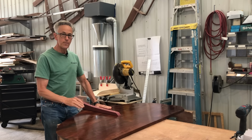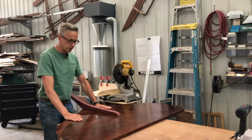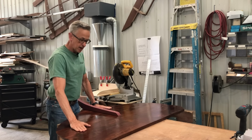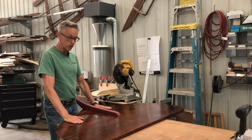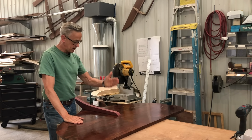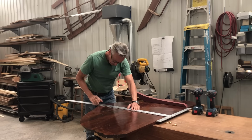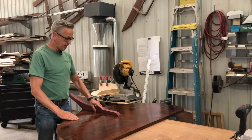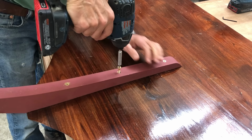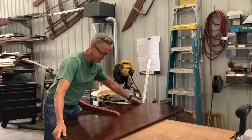Before we can put the Ribbands on, we need to prepare the transom to be placed on the jig. So the first thing I did was give the back side of it 3 coats of marine varnish, and then I installed the stern knee, for which I found the center line first, and then attached it with 3 brass screws. So we'll see how this fits on the jig.